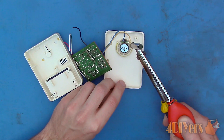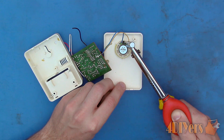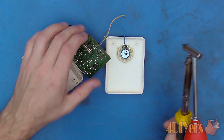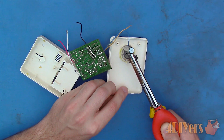Here I will be removing the wires which are directly connected to the speaker. Depress the bulb, heat up the connection, and once it's melted release the bulb to remove the solder. After that, depress the bulb into a container to dispose of any old solder. It's important to empty the desoldering tool when moving on to other components as this can squirt out hot melted solder on an area we don't want it to.